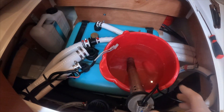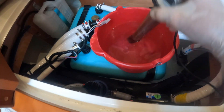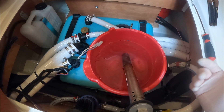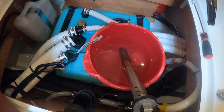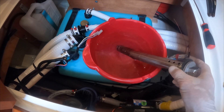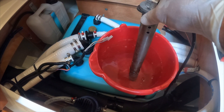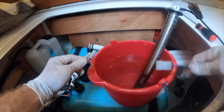We're back down here after cleaning and descaling this thing as much as possible. I'm putting it into a tube of water because right now the waste tank is empty. The issue was that this sender wasn't giving a proper reading — it always said the tank was full when it actually wasn't, which is stressful for a boat owner. So instead of filling the whole waste tank, we've got a little tester tube: every time I put the bobber float in here it'll float up the tube and give us a reading. We're going to reattach and re-plug this back in.